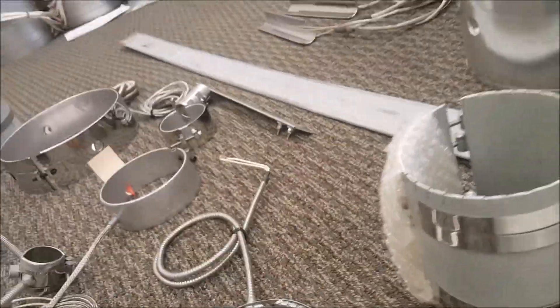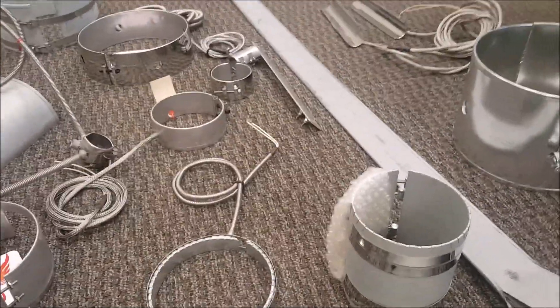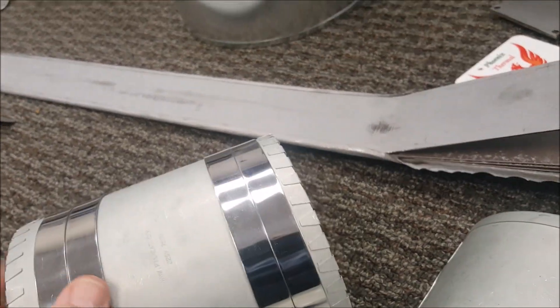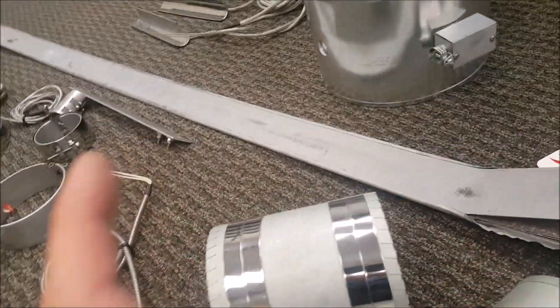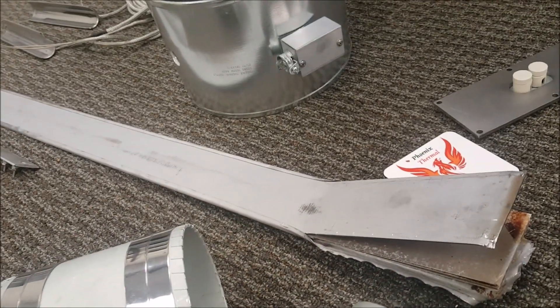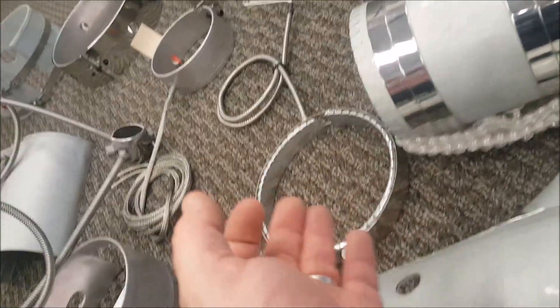With all these styles of heaters, we can do 120 volt, 240 volt, 480 volt, 600 volt, single phase, three phase, AC, DC — any kind of current. All these heaters are conductive style heaters. Conductive means heat transfer by touching. All of these heaters are to be strapped on, bolted on, and tightly put onto the product process. They need to get the heat away from the nichrome element inside the heater — getting that heat away means your process is getting warm and your heater is not overheating.